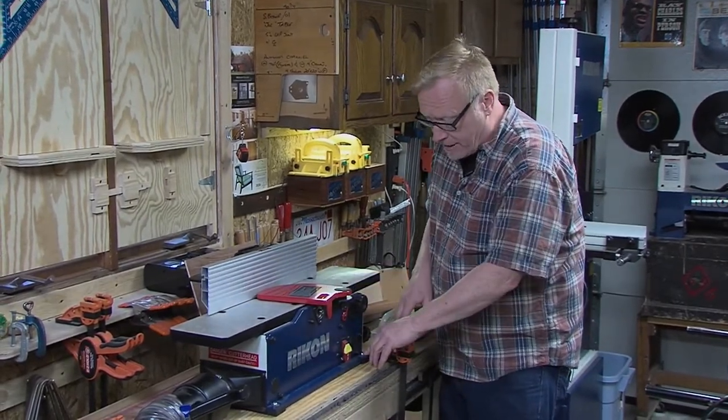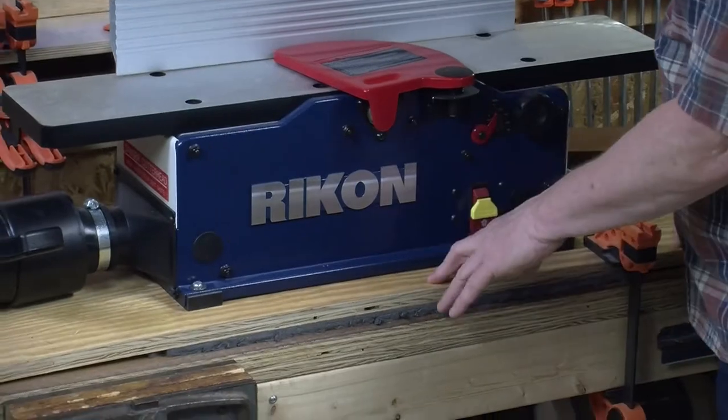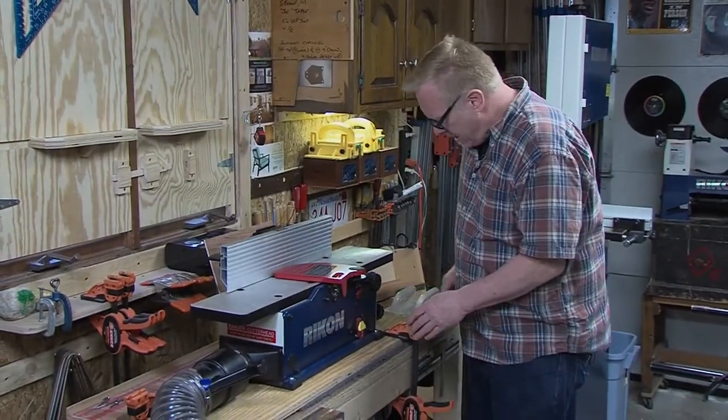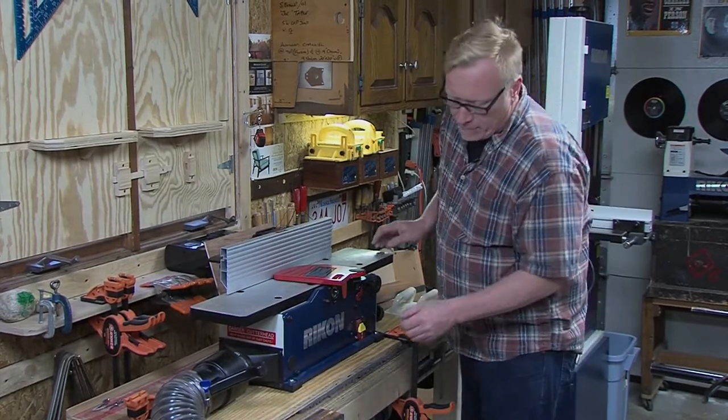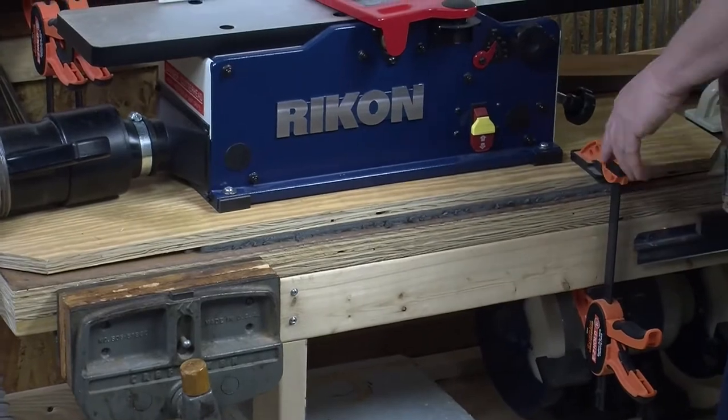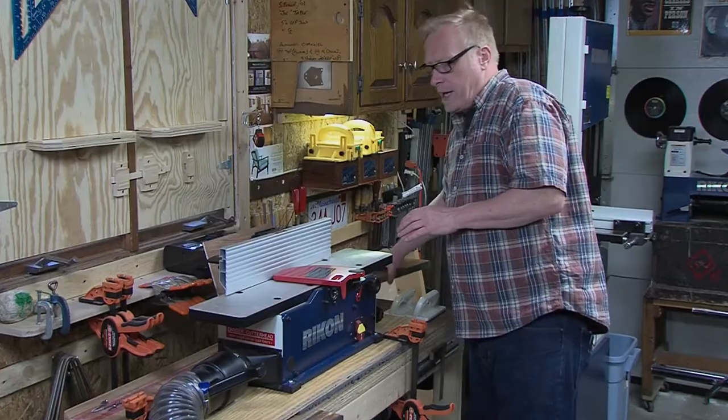I'm working in a small shop. If you have limited shop space, the six-inch bench-top jointers are perfect. I have a small shop dust collection system and together it's perfect for this shop. What I did is I attached it to a piece of three-quarter-inch plywood, bolted it down, and clamped it to the bench. Before I did that, this bench top's a little slick — I have a little piece of rubber mat I just stuck under there and it helps secure it.